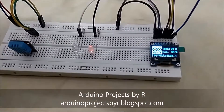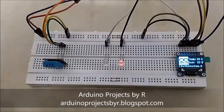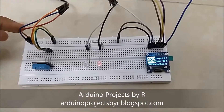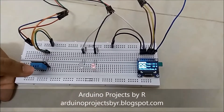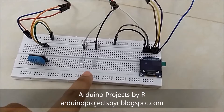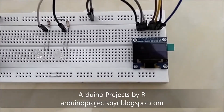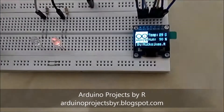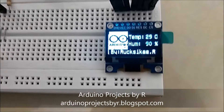I've used a delay period of two seconds for the DHT11, which means that the data is updated every two seconds. Now let's see the connections. The blue wire is connected to the ground and the red wire is connected to 5 volts. The orange wire belonging to the DHT11 is connected to D7. The blue LED is connected to D5 and the red LED is connected to D6.